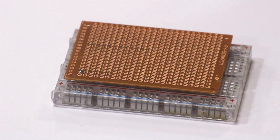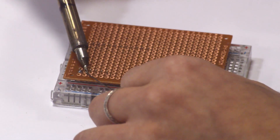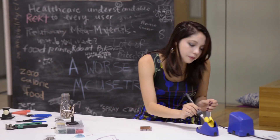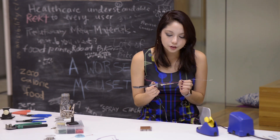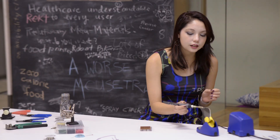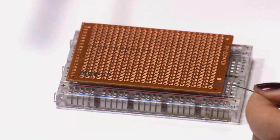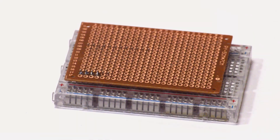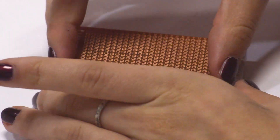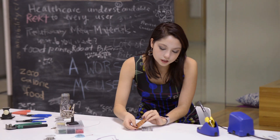To do that, I'm just gonna wrap around, tap the soldering iron on both, make sure I've got a pretty even amount, and then add solder in. And there you've got a nice joint — you want to get that nice little pyramid. Always be sure to be cleaning your tip frequently; it's kind of like painting — you want to make sure that your brush is always clean and has enough pigment on it. Keep in mind it's okay to start by putting your iron on the thing and letting it heat up a bit before you add your solder, because then it'll flow much more nicely.